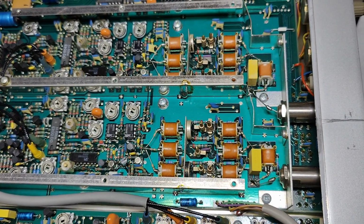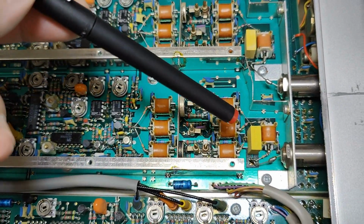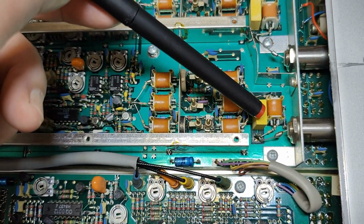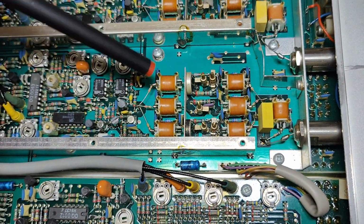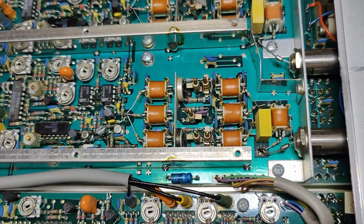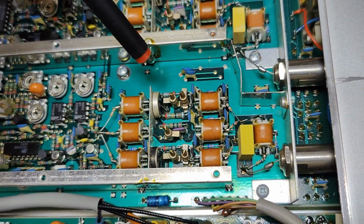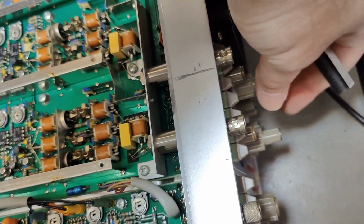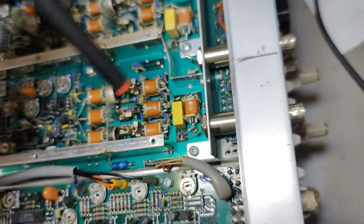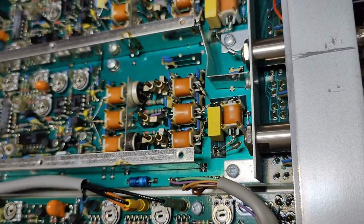Of course, you want to see the analog front end input here. Look at that. So this is the AC-DC capacitor, of course. And then the attenuator is, of course, made with reed relays, because everything in this one is software controllable. It looks like the attenuators and everything here go to handle stuff directly, but no, it goes via relays. And that is a very good way to do it, by the way.